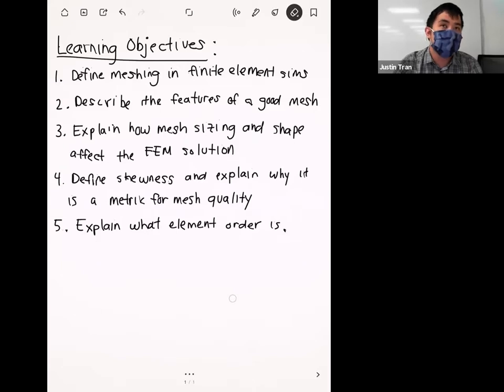Probably because the material we picked was isotropic, I'm guessing it behaves the same in tension as in compression. You should be able to load it with the same value of the force. You can try it though. Whatever force you find for compression, you can just make it a positive value and see if you get the exact same stresses. I think you should because it's an isotropic material.